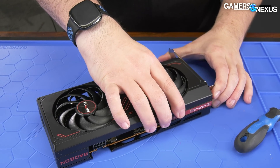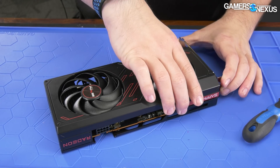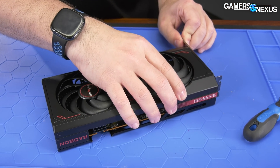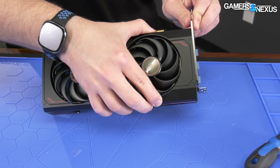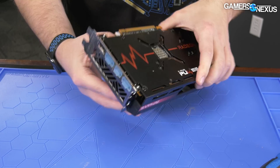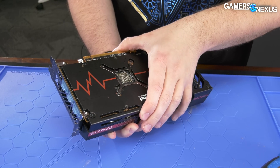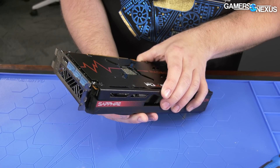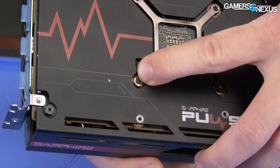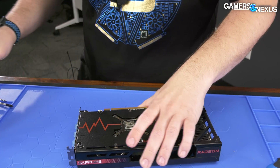We were just getting ready to tear it down and I immediately noticed there is a huge amount of play in here. I'm kind of concerned — I haven't looked at the thermal results yet, but that may be reflected in those. There's an awful lot of movement in this heat sink. Hopefully this is just the shroud and not the heat sink itself moving. Let's see if we can externally identify the source. I'm thinking it might be that the screws are not all the way in. I don't see any... well, someone's been in here before. This screw's got some damage on it. It's possible it's from assembly, but this is supposed to be fresh off the line — maybe this is just a sample that was rushed through.